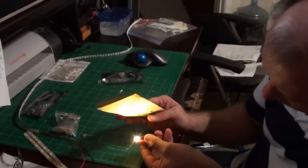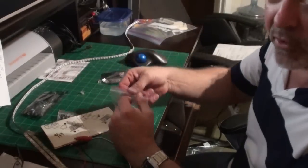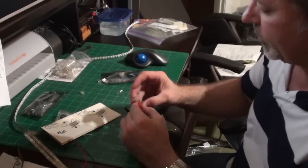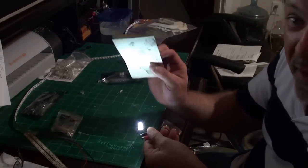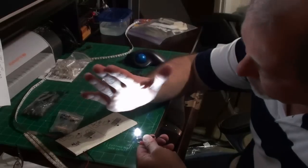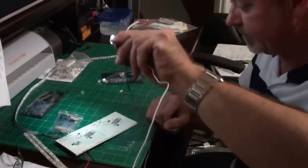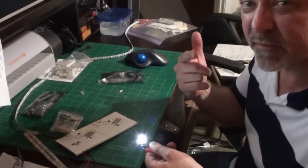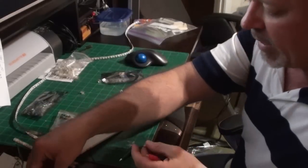The piranha is also a bit brighter than the flat tops and normal LEDs. Now if you want to talk bright, what I have in this bag are some 10mm LEDs — they're half-watt. Plugging one up to the power supply — they still have the spotlight effect, and I don't think it's that much brighter than the piranha, but it's definitely brighter. These other ones are 20 milliwatts; this is 500 milliwatts. So it's definitely consuming more power than it is brighter.